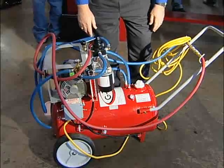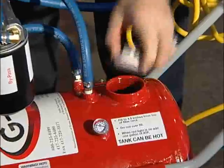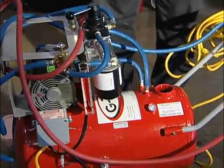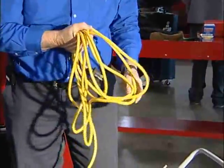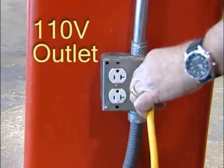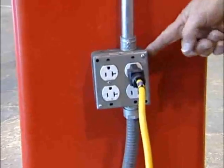We'll check our work with a check screen. The first thing you do when you remove the cooler from the box is remove the white cap — that's just for shipping, throw it away. Then plug the unit into a 115-volt outlet that's at least a minimum of a 15-amp circuit. Be sure it's a 110-volt outlet with a minimum of 15-amp service. Do not use an extension cord, do not plug it into a drop light, and make sure there are no other appliances on the same line.